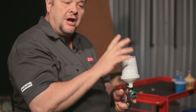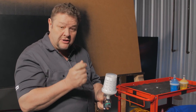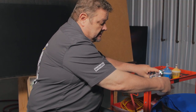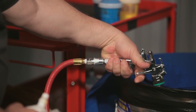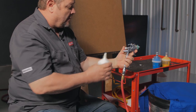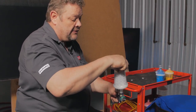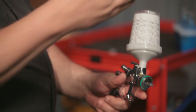When you're getting ready to switch a color out quickly, basically you push that top down so your air vent is closed, then turn the gun over, remove the bottle while the air is going, flip it over and blast it out into a receptacle to clean it. Grab your next color, keep the white on it, turn the gun over, slide that in, quarter turn, flip it back over, pop the air vent open to get airflow, and that quickly you can change a color.